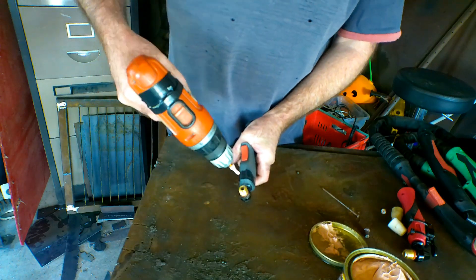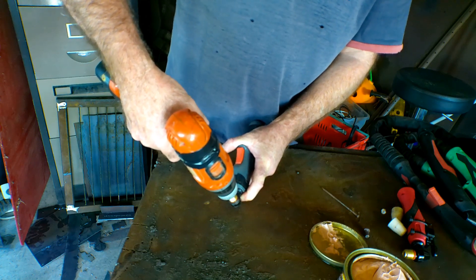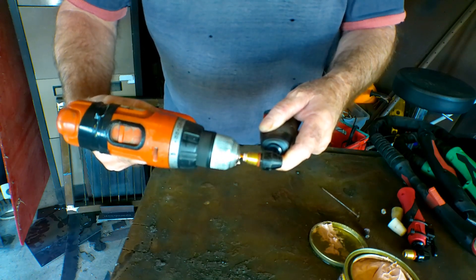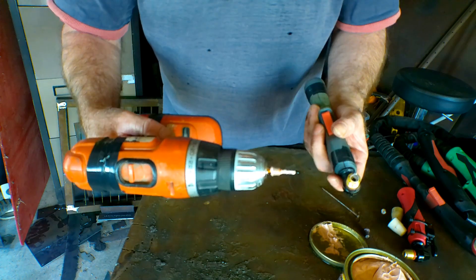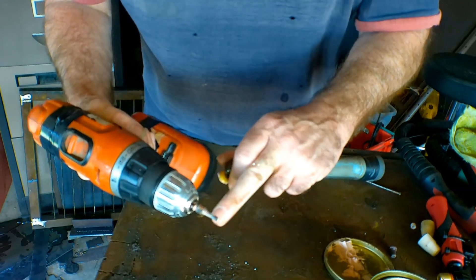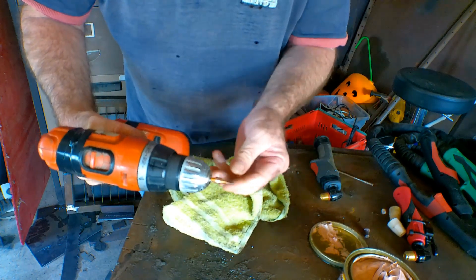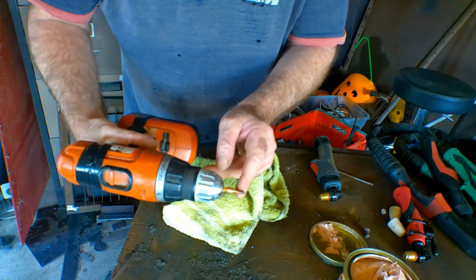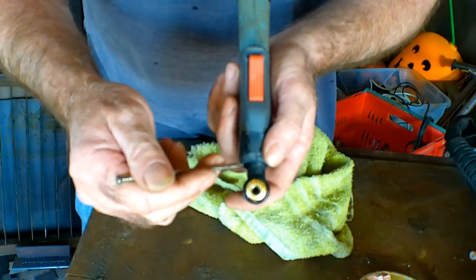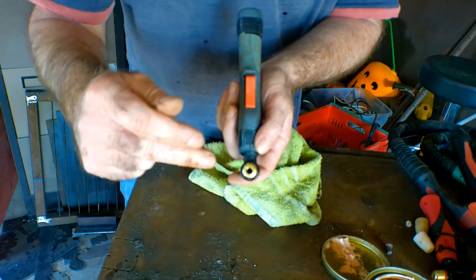Grab your torch, stick your electrode in there, and push it down home. It might take a little while. Can you see that, guys — all that black muck coming out of it? It's cleaning all that burnt stuff off. See how it's all dirty and mucky in there? It's really, really black in there. And it's starting to also clean up the electrode, because that electrode was pretty badly scored as well — but look at that, it's coming up as clean as a whistle. Can you see there where we've been rubbing on the inside of the torch? It's actually cleaned this up as well. That's as clean as a whistle in there now — it's got all the burns off it. You'll be able to reassemble your electrode in there, no worries at all, and you can start all over again. As long as you remember to tighten up that ceramic, you're not going to get that vibration and it won't start burning out again.